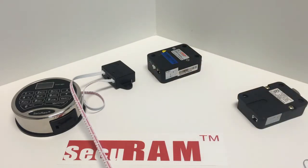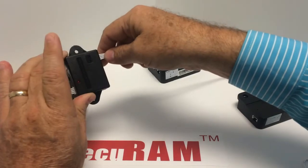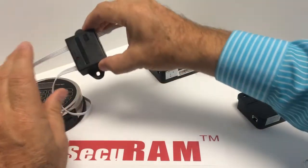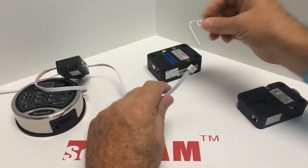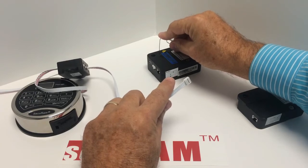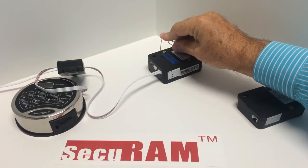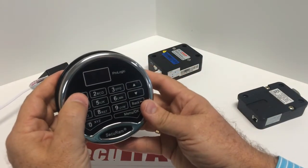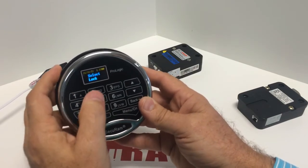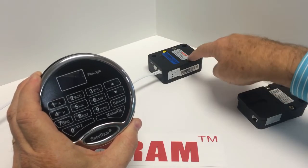Connect lock number two to a port — I typically use the next port, so J2, J3, or J4, but it really doesn't matter. Once the lock is named, it doesn't matter which port it's connected to. With the cable connected, use the reset hole: press one, two, three times, then continue to press down and hold and plug in the lock cable from the junction box. You can hear the spring bolt lock's motor cycle when you plug it in. Hold for five seconds, then release. Enter your super code, and when asked which lock to open, select lock number two — and lock number two opens, naming it lock number two in the system.